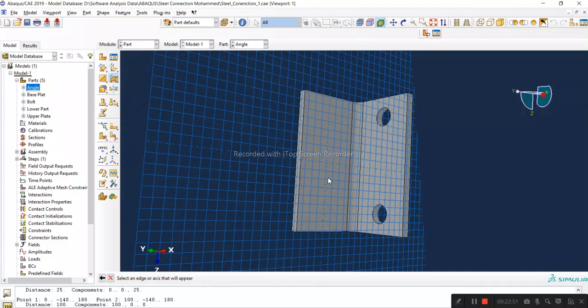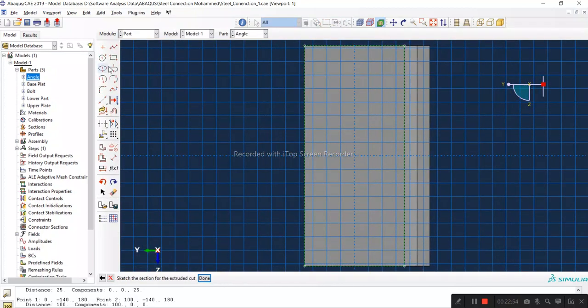I need, let's say, this one to appear right here, and again just two random holes, circles, and again I have to put the dimensions. The radius of the circle is 12.5, same here, 12.5, and the distance between these two is 128, and finally the distance from this location to this is 26, and you can also check this one, it should be 26 as well.